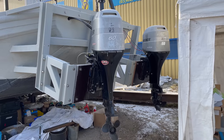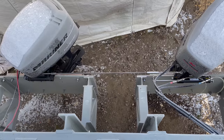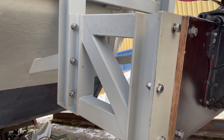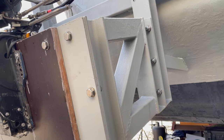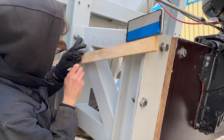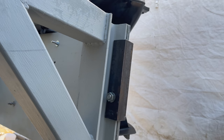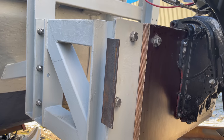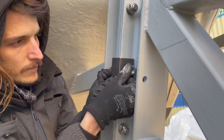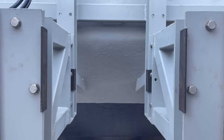We're gonna stay right here aft of the boat, where it's time to install a service platform, allowing a person to stand between the two motors. I'm gonna make use of the existing bolts to attach it on both sides of the transoms. First I'm gonna draw a line that's level with the boat, knowing that the boat is offset by about one and a half degrees. I drilled a hole into an angle profile so that I can bolt it onto the structure. I'll do the same on the other side, and so now I've got four strong points of attachment for the future platform.